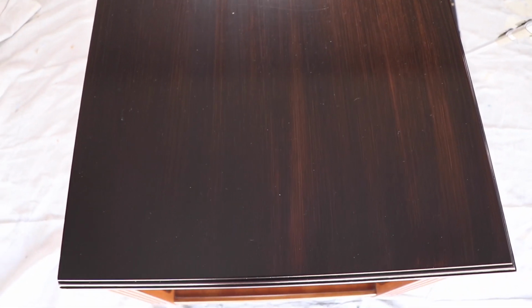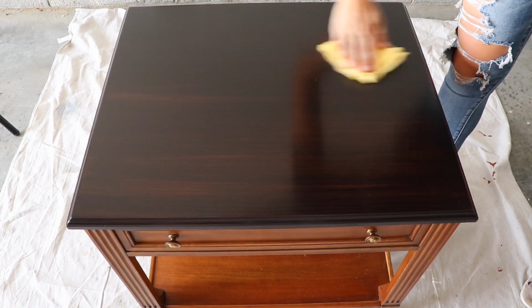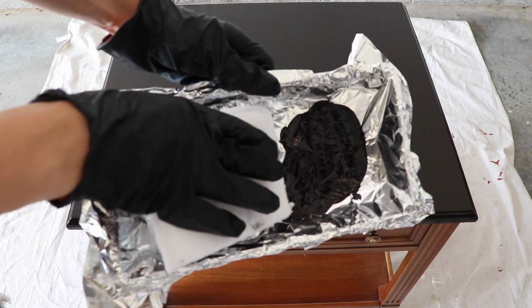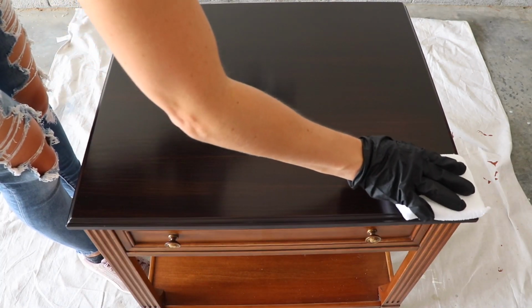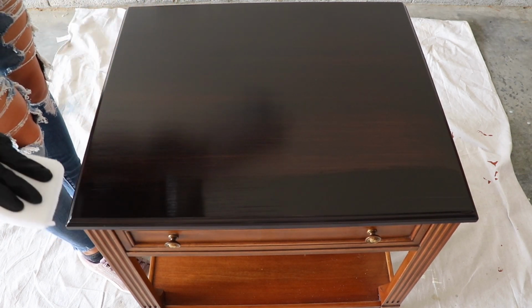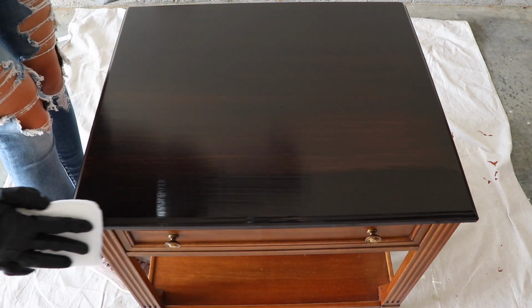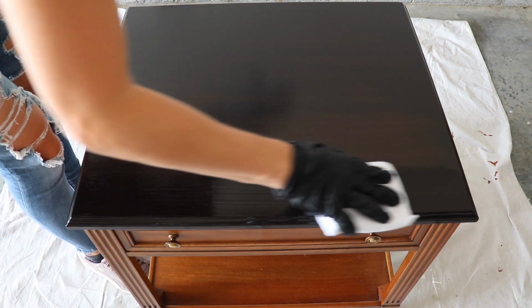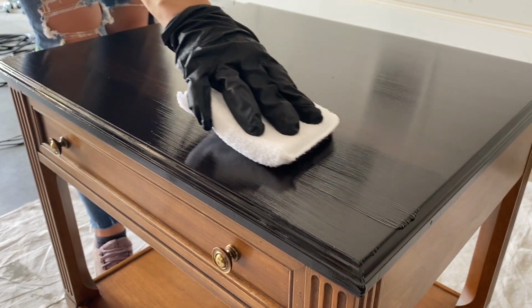So this is actually looking pretty good, and because I went with the wood grain, it almost has this wood grain effect to it, but I wanted mine really dark like my original one that I did, so I waited another 24 hours, and this is my third and final coat. By my third coat, I found that putting it in a little paint rolling pan like that was a way better way to get an even application of the gel stain on the applicator pad, so I would definitely recommend doing that. So here's my third coat going on just the way the first and the second did.